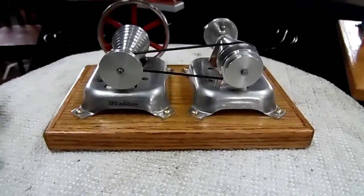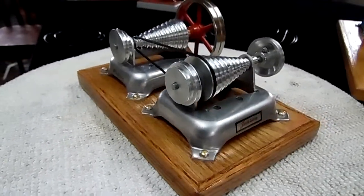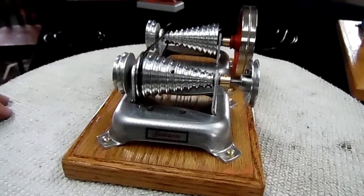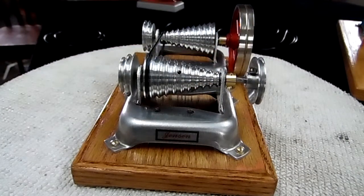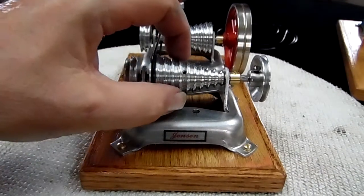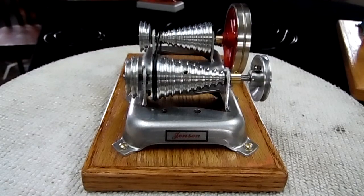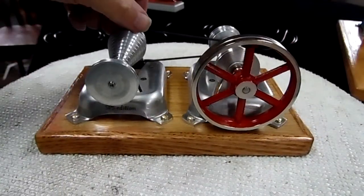There are ball bearings in each of the towers. I took a little special care with this one, and I've got brass shims — or collars — right here. They have a lip on them to ride against, as do these two matching cone pulleys, to ride against the inside sleeve of the ball bearing. So nothing moves left or right, there's no pressure on the side of the bearing, it doesn't scrape off any speed, and it runs really efficiently.